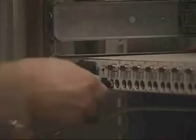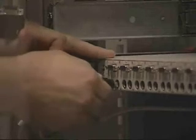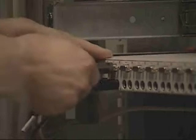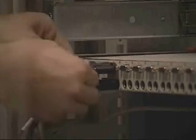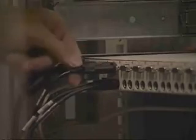Connect the master keyboard, monitor, and mouse cables to the rear of the switch box. Connect the keyboard, monitor, and mouse cables for each server to the appropriate connections that support each server. For example, cable bundle 1 from server 1 would go in connection 1.